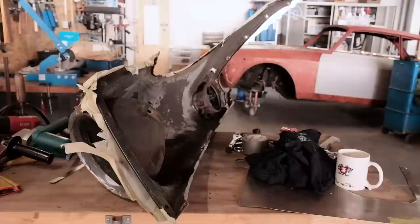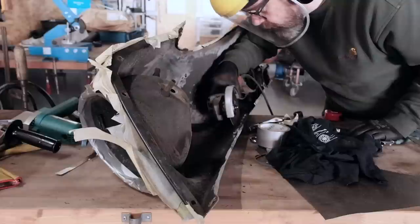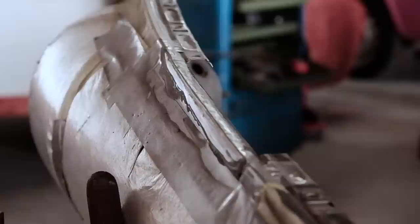With the outer side shaped properly, the inside was trimmed with the cutting disc of the angle grinder, not with a grinding disc. It's a bit of a misuse of that thin disc because actually it doesn't resist bending forces very well. But with a little concentration and some face protection, everything's going to be fine. And that was panel one.